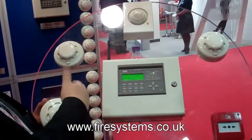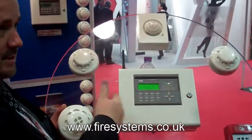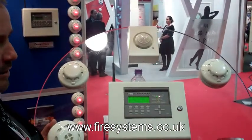What zone do you want me to be on? You've got the option of an 8 zone, a 20 zone, or a 100 zone panel. And then for heat detector and smoke detector, you've got a sensitivity option, so you can set sensitivity. For a call point there aren't any sensitivity options obviously.